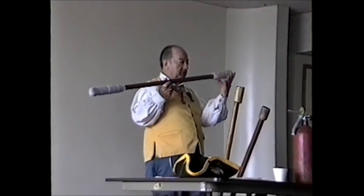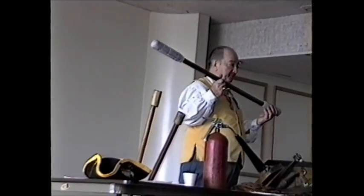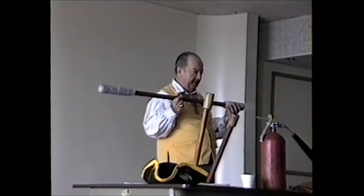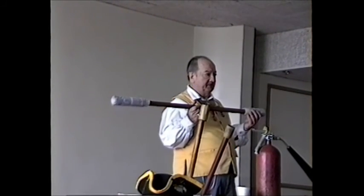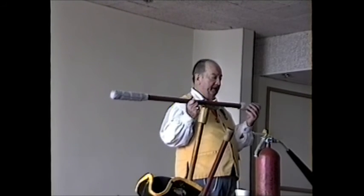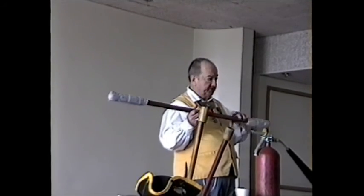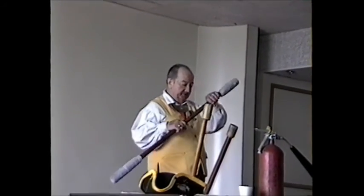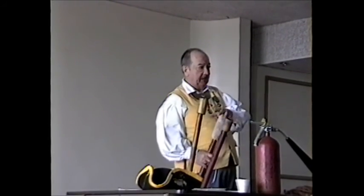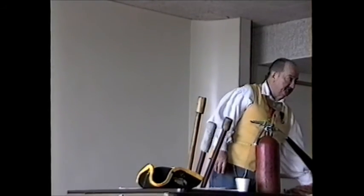It should be wool, lamb's wool, with the size piece I have, something that fits very nicely if you have a 2 3/16 diameter barrel. Something that works very nicely is a heavy lamb's wool paint roller. Staple a paint roller onto the rod, and make sure that the end is well covered and stapled down. Don't try to use epoxy. You can use epoxy, but staple it just to make sure.